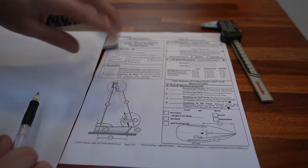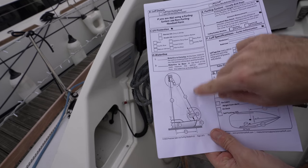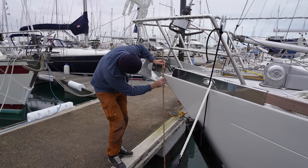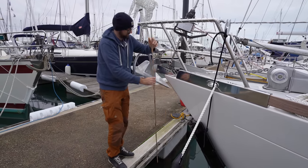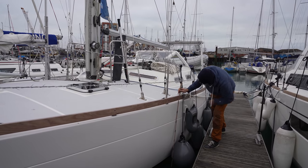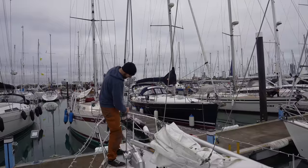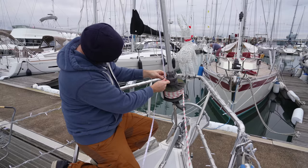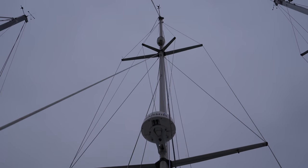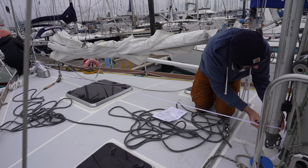On page two is where we start to grab measurements off of the boat. Let's do this alphabetically — D, E, F, G. There's a drawing showing D1 and D2. D1 is 157 centimeters. D2 is by the front of the mast from the waterline up to the edge of the deck — that is 120 centimeters. E1 looks to be about 71 centimeters. E2 looks like 14 meters and 12 centimeters. G1, slightly imprecise because of a radar reflector, is 14.36. G2 is 4 meters 99 centimeters.